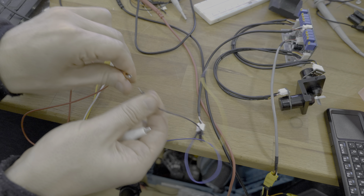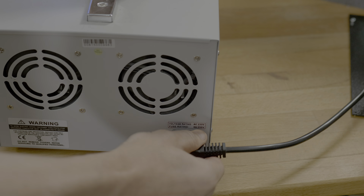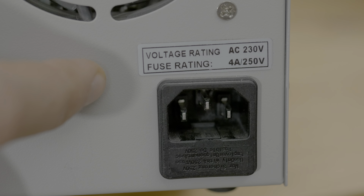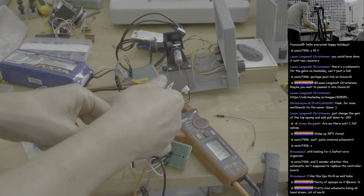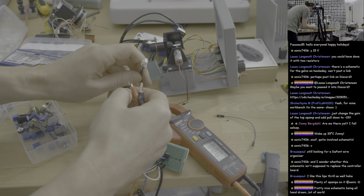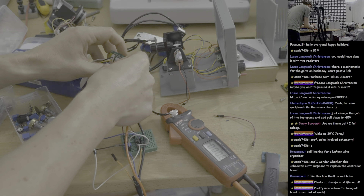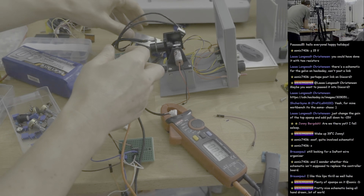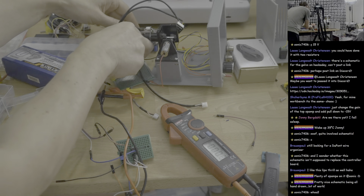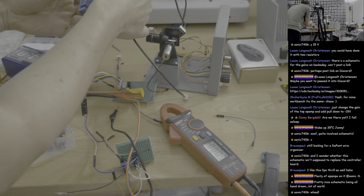However there was a slight issue. If I connected an audio cable with a different ground level but both actual grounds are connected through mains, this would blow up. I don't have an insulating transformer so I wanted to drive it from a 6-cell lipo, just by tapping into the different voltage levels at the balancing connector. In theory a good idea — unless you flip some cables in the process. Reversing the voltage wasn't very healthy to the electrolytic caps, and people on the stream spotted a crater on the minus 9 volt regulator where some magic smoke escaped.